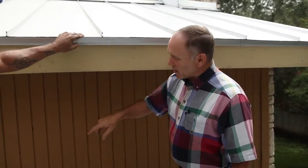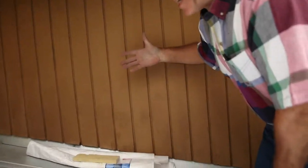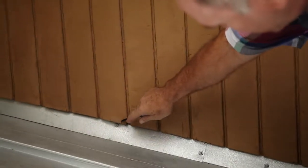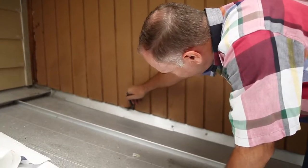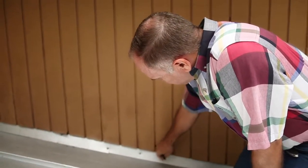It just gets very small little fissures in it. Juan, back up a little bit — let's show Justin what we deal with on siding that looks painted from the outside. Can you focus in on here, Justin, and see the little cracks that are in here? These little cracks and minute little splits end up creating soft spots in this. To the common user, the homeowner, they're not going to know that this is happening, but it's literally just falling apart — it's soft, just coming apart. So this is why fiber cement is so much better. None of this micro splitting, none of these little fissures that get really soft, occurs with fiber cement like it does with wood.